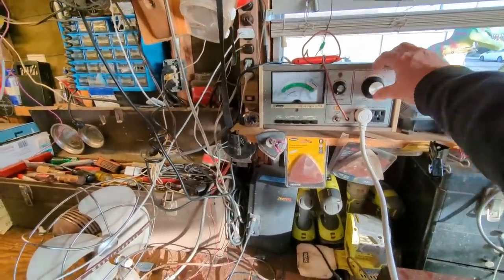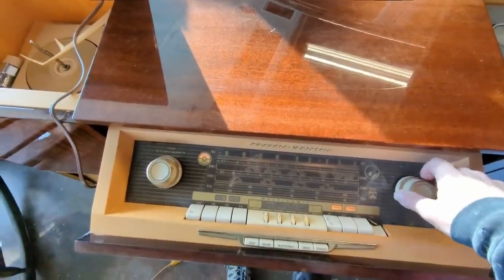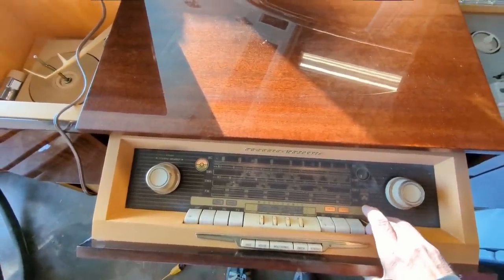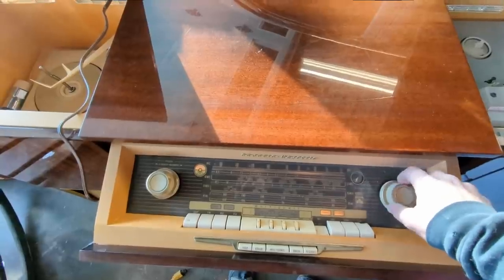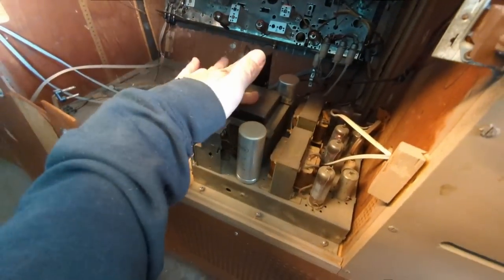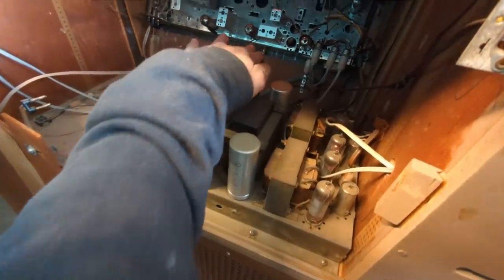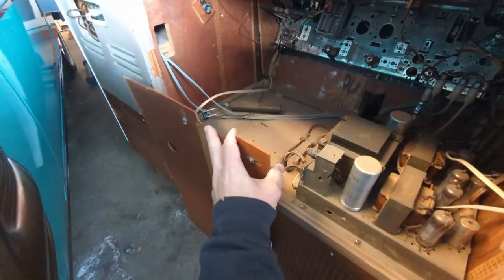Let's go ahead and go all the way. The eye tube is completely dead. Everything's running pretty cool so far. This is the FM-related tube. By the way, don't do what I'm doing — you should not stick your hands into energized electronics like that. I think my loop antenna isn't connected, so let me try to connect that. Okay — radio does not work, audio obviously is working. It could be any number of things: a bad contact, or a bad tube.